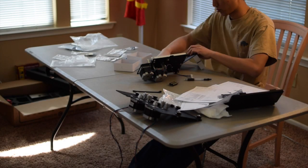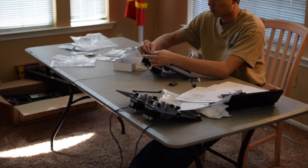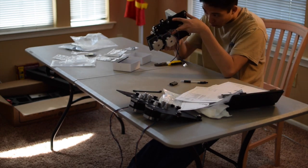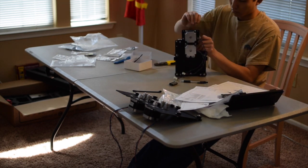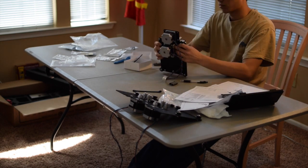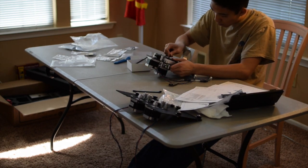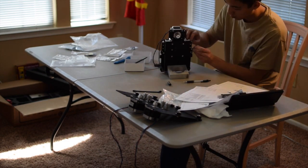After bolting on the spindle mount, you're ready to put together the combined X-Z assembly. Wrap your closed loop of GT2 belting around the fixed pulley and then keep it out of the way as you slide the Z-axis carriage plate onto the rails. Make sure the GT2 belt wraps around the top pulley on the Z-stepper and the flanged bearing on the bottom. Loosen the standoff on the Z-carriage plate and drag it down to tension the belt. You'll also want to install springs between the outer standoffs on the X and Z plates.